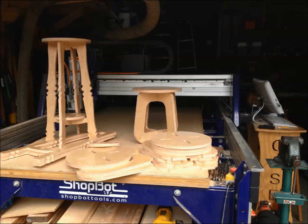You can spend some time on dog-boning and tool-pathing, but that's covered in another tutorial. The key tips here: for making your slots, the machine will cut at exactly what you set — if you set 0.69, the parts may not slide together. Add those tolerances in. Make it easy on yourself when modifying. Feel free to share better approaches on the forum. Hopefully what you saw today will help you make multiple parts out of different thickness materials for nice slot-together projects. Thank you very much, see you next time.